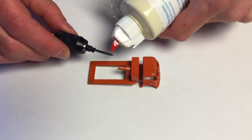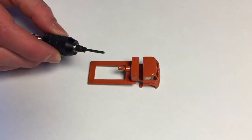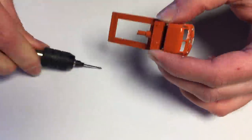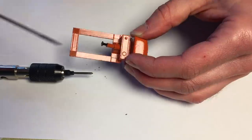Although I know I should have tapped the rivet post before painting the model I still needed to do this after painting it. I gently thread the rivet post to make sure there's enough thread to fit the screw that will hold the barrel. Again I'm using a bit of oil to smoothen the threading process.